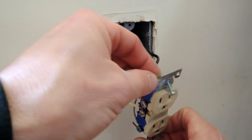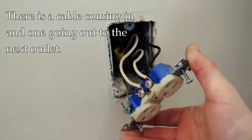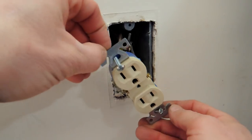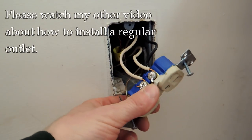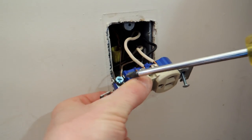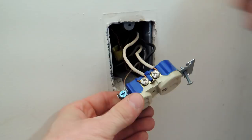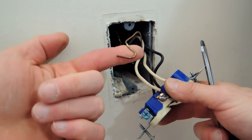This is a good candidate. All you see here is that it's just in the middle of a run — this circuit has a bunch of outlets on it and this is just one among many. All you have coming in are two cables, one going in and one going out. I'm going to remove this outlet to get it out of the way and then we'll start working on the new one. You can see the ground wire here — it looks blue but it's supposed to be green — the ground is that bare wire, and it was looped around the screw terminal.